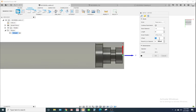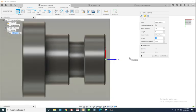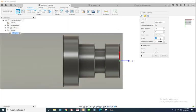That's because when you're sawing larger diameter stock, the saw tends to walk even more. So when you face it, it may not clean up. And vice versa, the smaller the stock diameter, the less you have to face because the saw is going to walk less. But 50 thousandths is good. Anywhere from 20 to 100 thousandths is fine, depending on how straight your saw cut is.